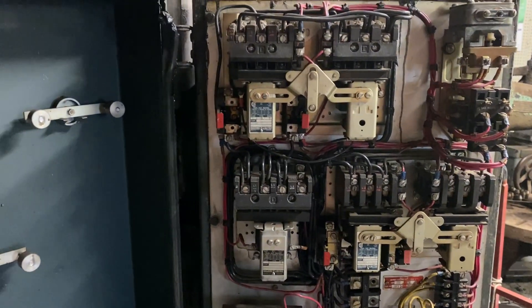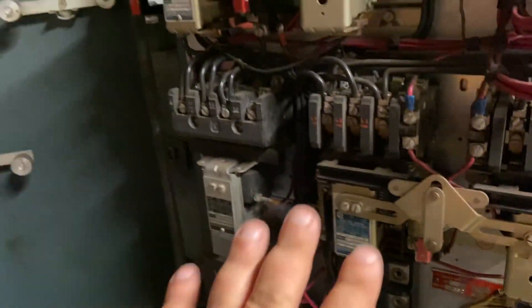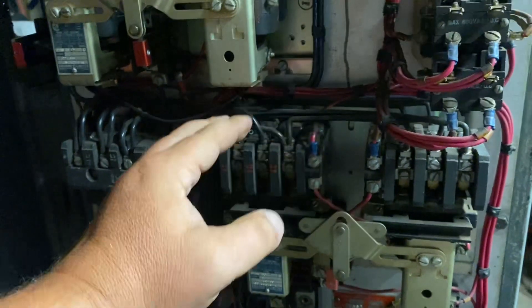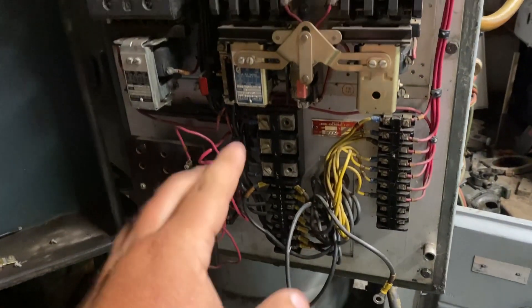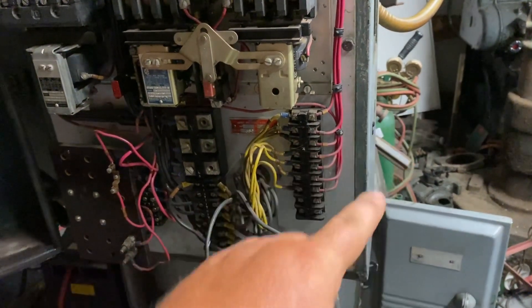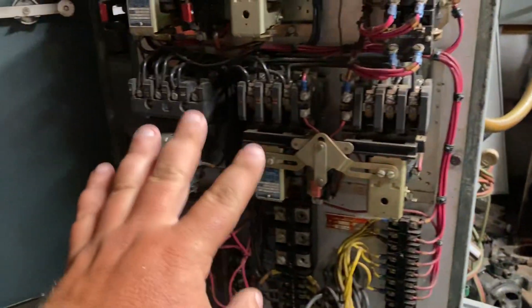Before that, make sure that most machines are dual voltage. The older ones I've dealt with — the wiring inside is sized for both voltages, or amp loads rather, so keep that in mind. Make sure your incoming power cord is heavy enough gauge for the amps the machine is going to use. This is mostly relevant when you're going from high voltage to low, because low voltage draws more amps.